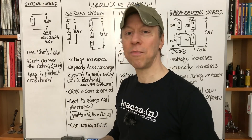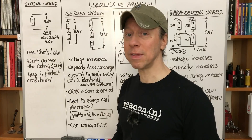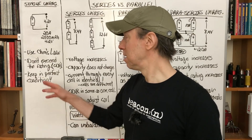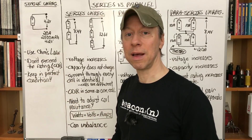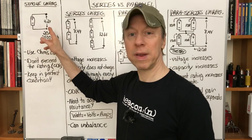Safety stuff I'll always like to emphasize, because it is really important — these are very powerful batteries and they can react very badly: explosions, fires, if they're short-circuited. So keep them in good condition and don't exceed the rating on them. We've got 4.2 volts across the battery, 20 amps capability.